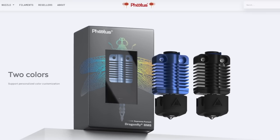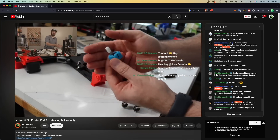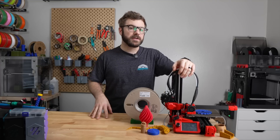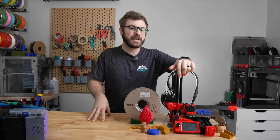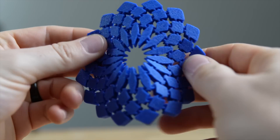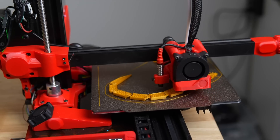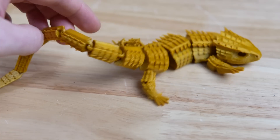The mounting points on the heat sink look identical to the Micro Swiss or Dragonfly hotends, so I may end up doing a complete swap in the future. For now, unless you're planning on printing with higher-temp materials, I would recommend just going with the included PTFE-lined heatbreak. I know a few others running that PTFE-lined heatbreak who have not had any issues, and the prints I got when pushing flow or in between extrusion issues really are not half bad.